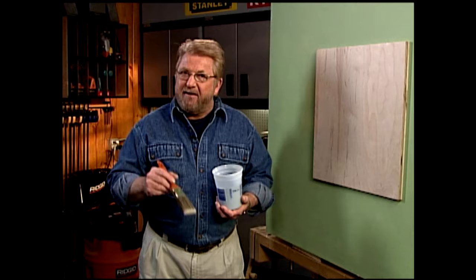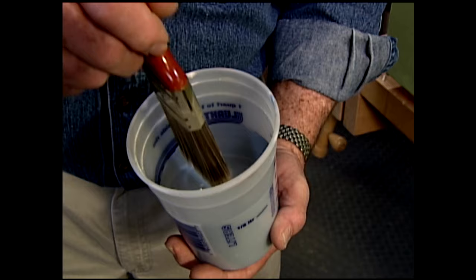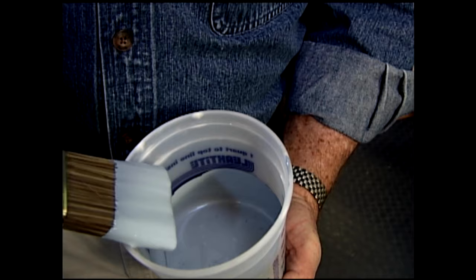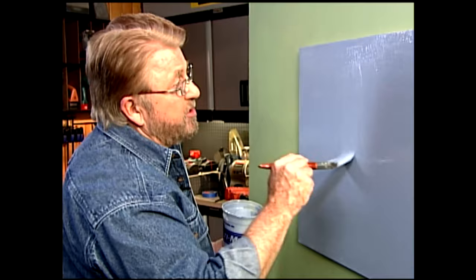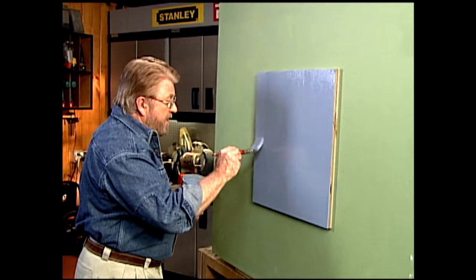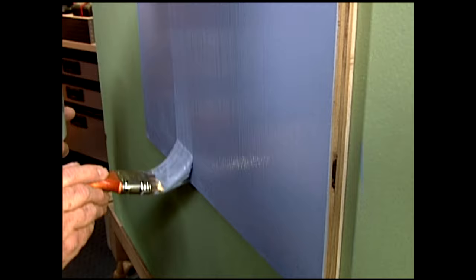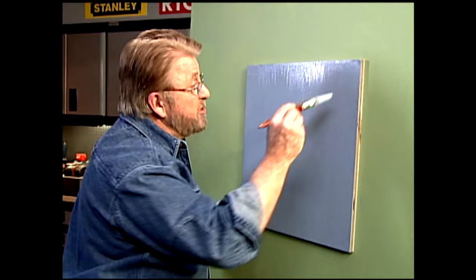A lot of my painting I do with a roller, but from time to time when I'm doing panels or cabinets, I work with a brush. Here are a couple of techniques for better brush results. When loading my brush, I dip it about half to two-thirds of the way in, and instead of dragging it on the side of the container — which pulls all the paint back out — I tap it. That removes the excess and helps avoid dripping, but still leaves plenty of paint in the bristles. When I reverse brush direction I tend to leave horizontal lines. Once I've covered an area, I come back, re-wet my brush, and make long strokes from top to bottom, overlapping — giving one long, even, smooth brush stroke. This process is called striking off.